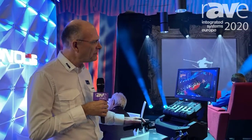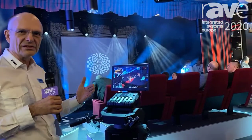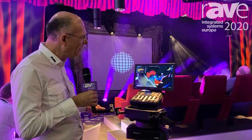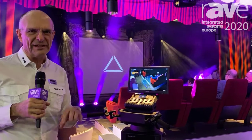Talking about the iris — if you have many of them and you want all the spots to stay the same size, it can be done automatically. You can even map the dimmer, because when the actor gets closer to the light it would be in a brighter position. So when you move to the very front, the dimmer is applied: the light dims down and maintains the same lux value on the person.